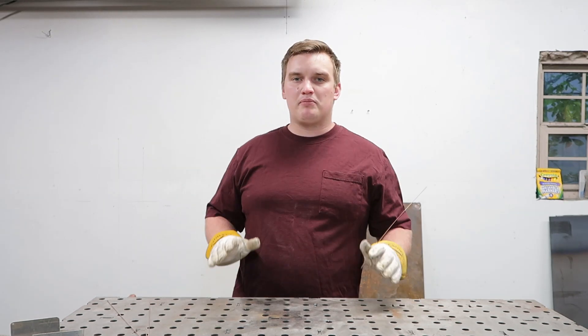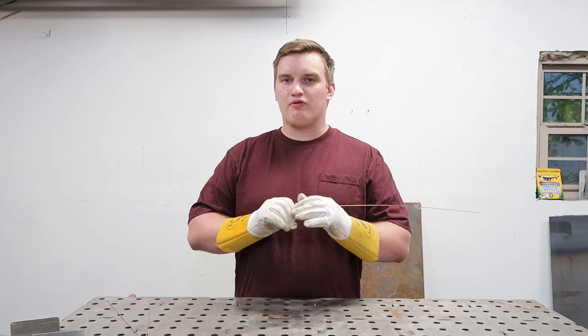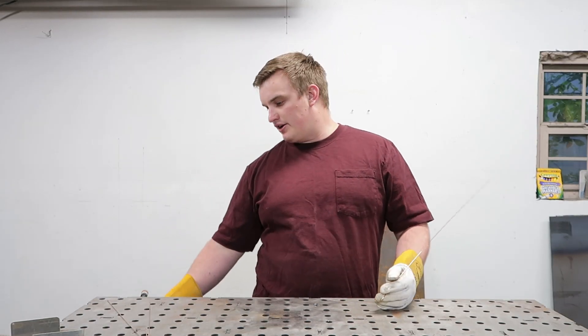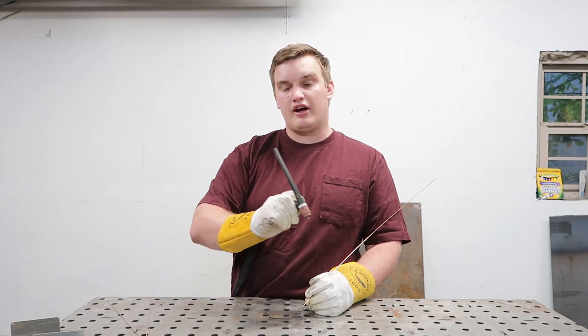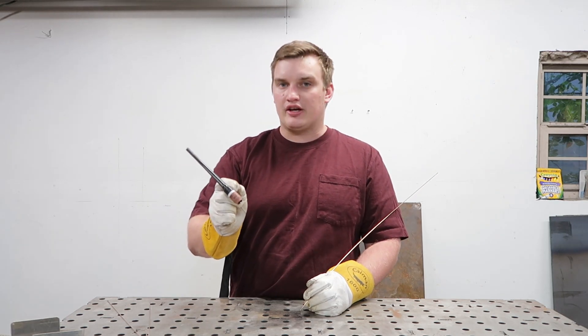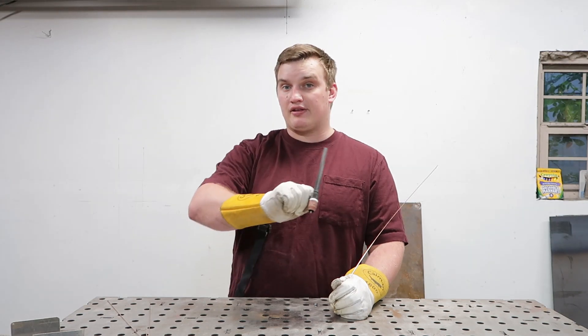Today's video — we are still not going to be even firing up the welder. I firmly believe that if you can conquer a few of these exercises before you even turn the welder on, it is going to make your life so much easier. This exercise is a dry run. A dry run is when you take your torch, assume the position that you're going to be welding in, run your torch over the area the weld is intended to go, and try to maintain a consistent speed and motion without varying from the path of your intended weld.